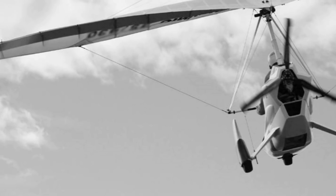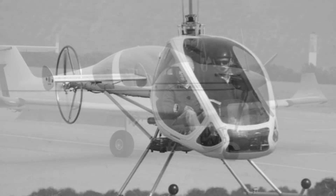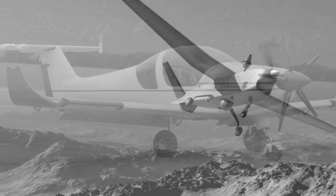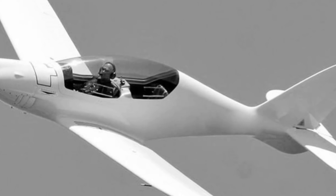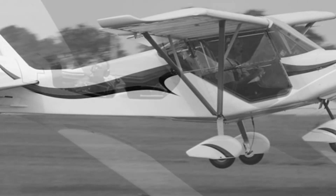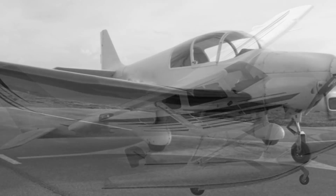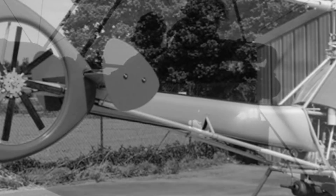How challenging was it to install? Well, like all propellers you have a hub. We use a very large three-inch spacer to get our blades away from our trailing edge. The spacer on the Duke is bolted directly to the hub with flange bushings, and then the propeller is bolted directly to the spacer. They also have drive pins in the spacer and in the hub, so the drive pins locate and secure the propeller — it's a very solid system.